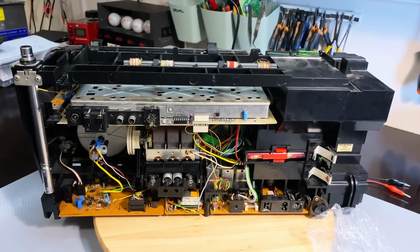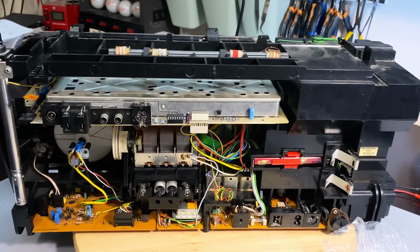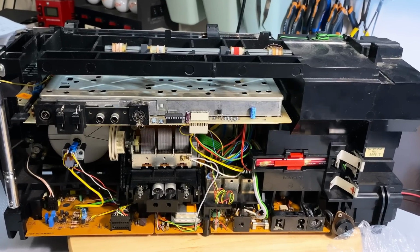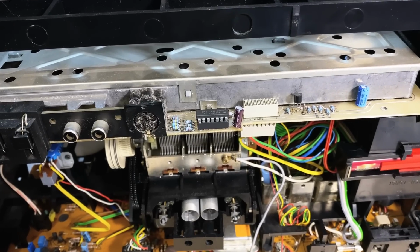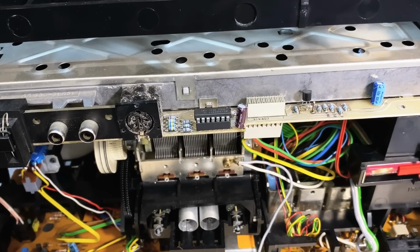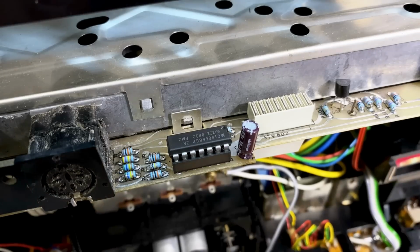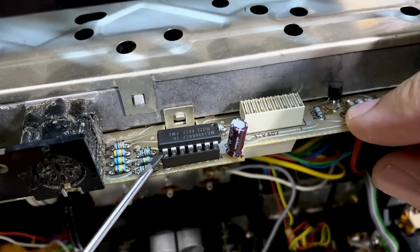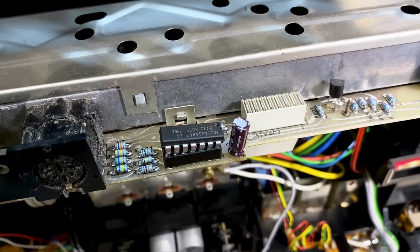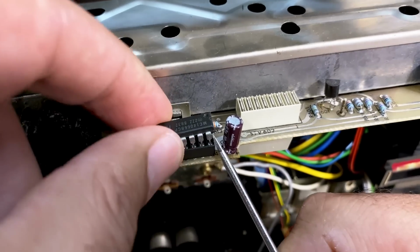Right, you may recall the first issue we had was that selector switch, or the audio selector IC, which has an incorporated mute circuit. That's the guy over there. It's CD4066, but this one was actually, I think, a proprietary IC that they relabeled. First thing you'll do is remove the old IC, which I put in at the end there to test it again with the socket. Makes life a lot easier.